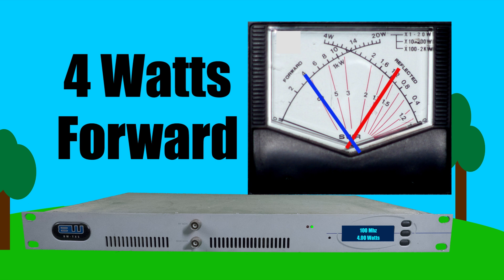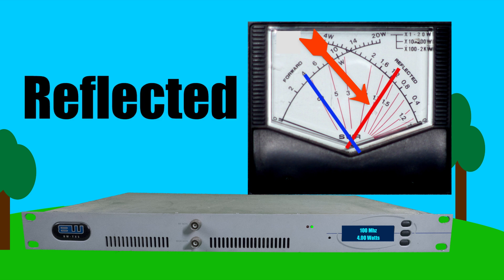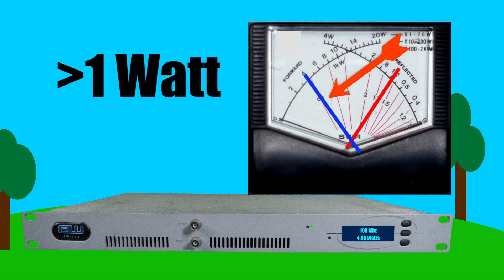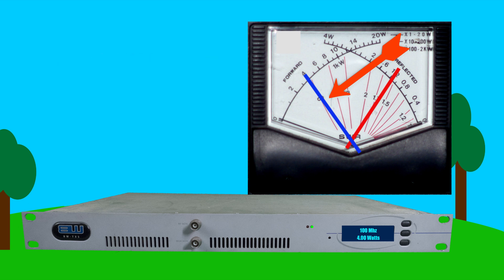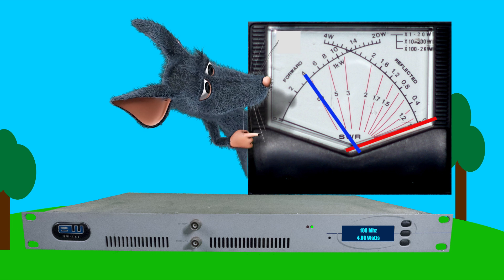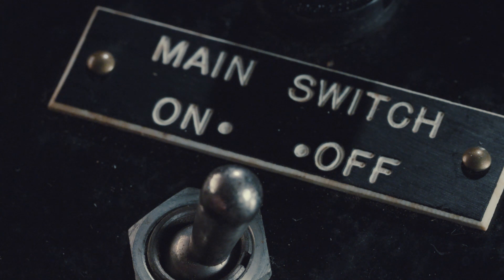In this case, 4 watts. You will also see what signal is being reflected back by the antenna on the second needle called reflected. This is the indication of how much the antenna needs to be adjusted. You need at least 1 watt of transmitter power to adjust it accurately, but 4 watts is about the optimal amount. Less than 1 watt and the reflected power needle might not move enough to see the adjustments. Even if you intend broadcasting with less than 1 watt, you need to tune your antenna with at least 1 watt, then turn the power down when you broadcast. If your transmitter does not have an output protector built in and you see a massive return signal, you will need to switch off the transmitter as quickly as you can to not damage it, as it might blow up while you are tuning.